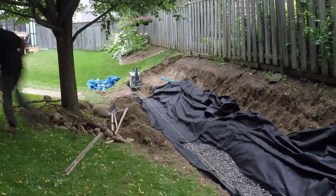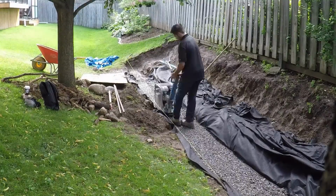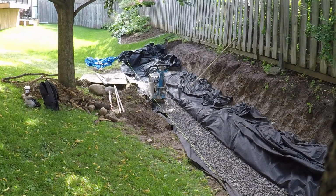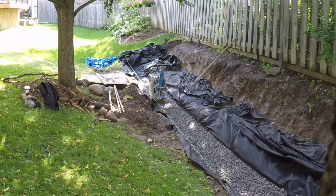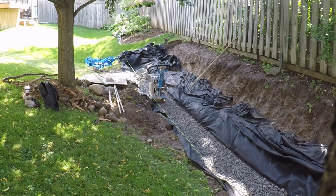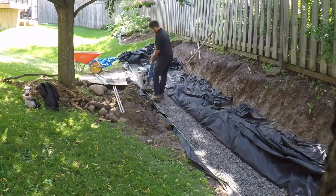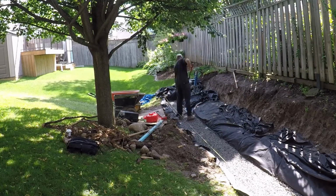And this of course comes after that preparation leading up to it. Everything from planning your retaining wall build, from the location, deciding how deep you're digging for your retaining wall, as well as that width of the trench, disposing of that excavated material, lining it with a geotextile to separate your subsoil from your base material, installing that base material, compacting it, and getting it to a point where you're ready to install that initial course.